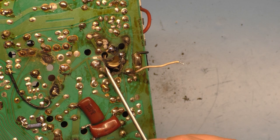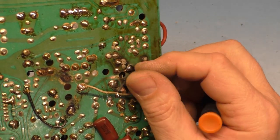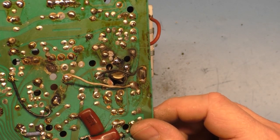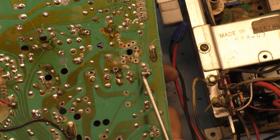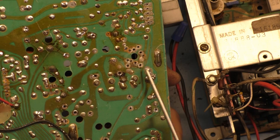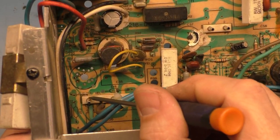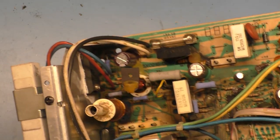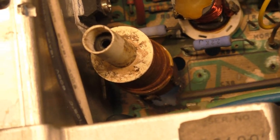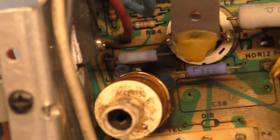So, okay, we don't need to worry about this pad here, because this will connect. Oh, you know what? That runs over to that one. Wait a minute, this is the one that runs to that pad. Well, I don't think that jumper was ever even there, quite honestly, because there's no other pad there. If we look at this one again, that jumper's across to here. But they've got it going to the opposite side. Yeah, well, I don't think that there was ever anything there, because we would see the burned up remnant. If there was a jumper here and this all burned up, we'd still see this side here that was in the hole. And on this one, it's not there. There's nothing there in that hole right there. There's nothing there. So 99.99999% sure that we don't need to worry about that.